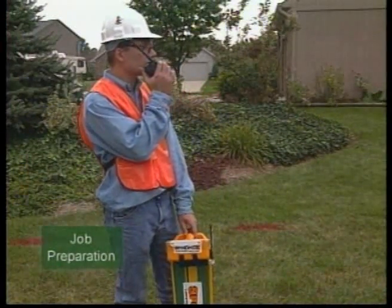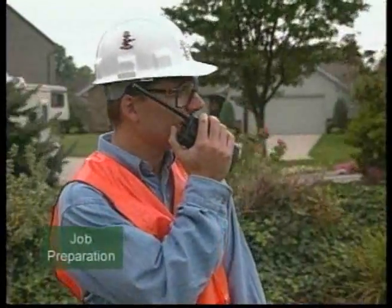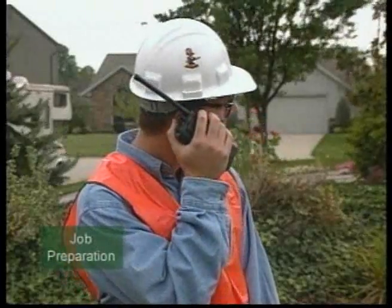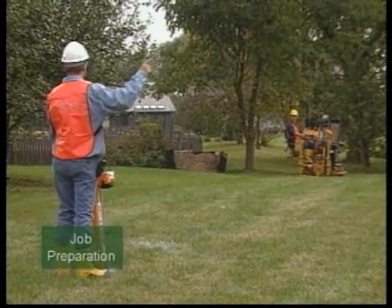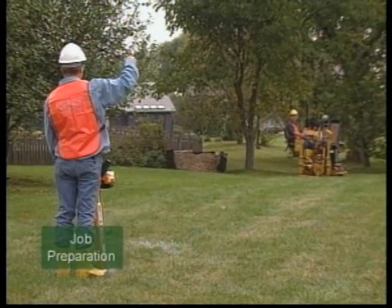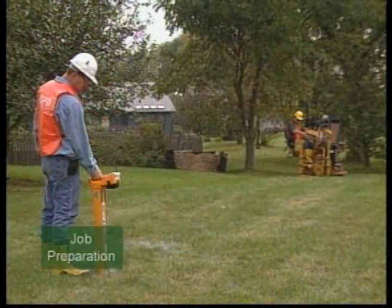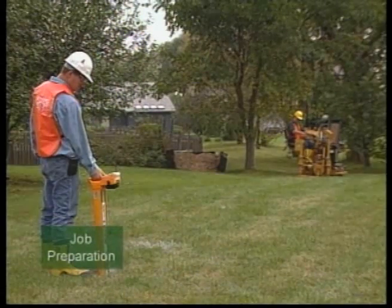It is also a good time to establish effective two-way communication with the drill operator. Radios are used most often. Radio protocol must be agreed upon, including confirmation of all messages received. If visual signals are to be used, they also must be agreed upon, and each sent message must be acknowledged. Effective communication is vital. You must maintain close communication with the drill operator.